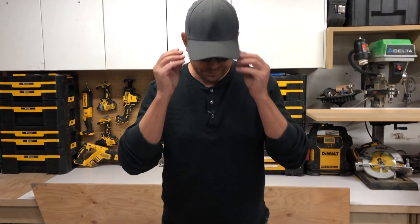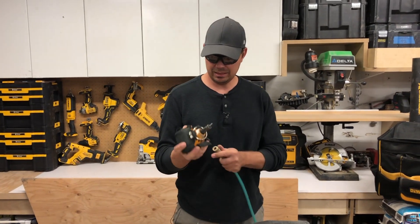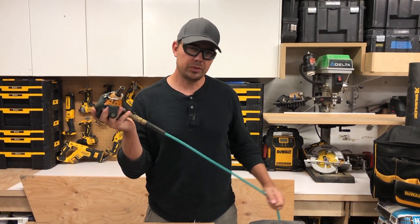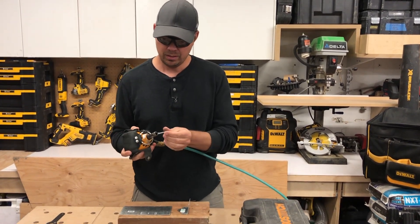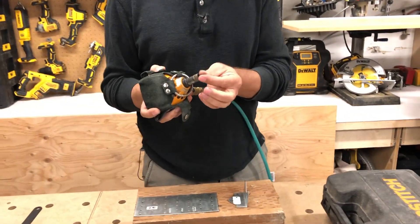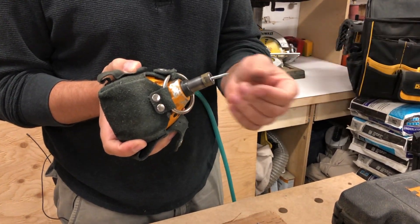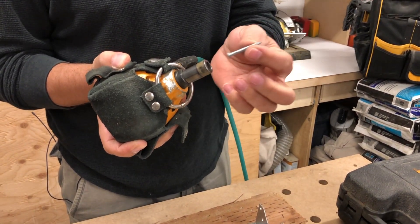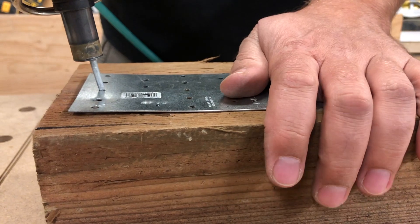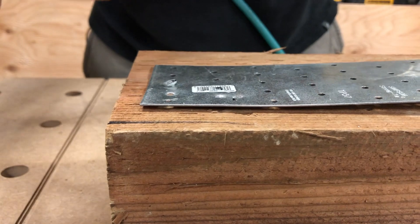Getting my glasses on here. Make sure you're always wearing glasses when you're using pneumatic guns. These always sort of leak a little bit of air — you can kind of hear them. You put the nail in — don't press it in because it'll start to shoot, so just drop it in. If I press it in with my hand this thing would shoot into my finger or shoot out, so you've got to be very careful. Line the nail up to your hole and press down with your palm.